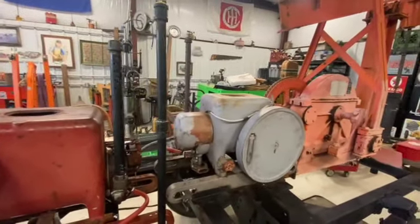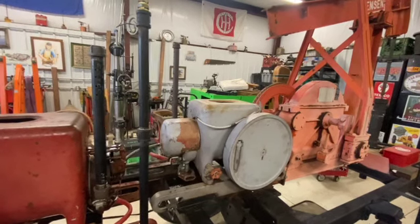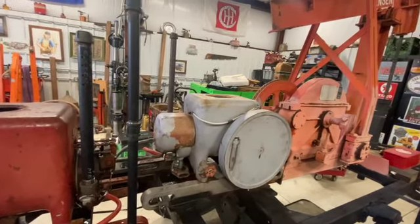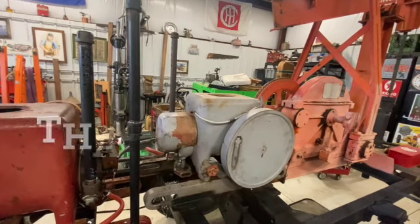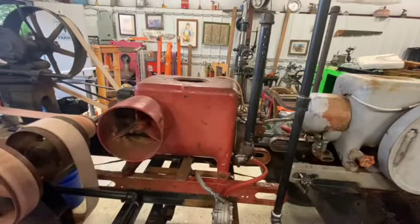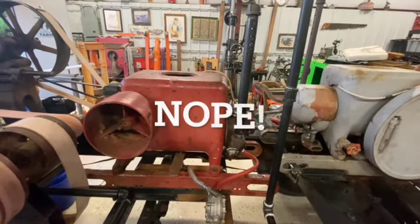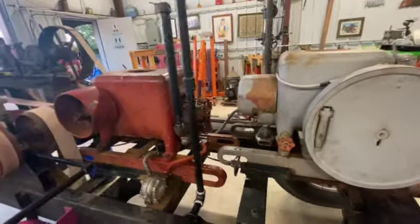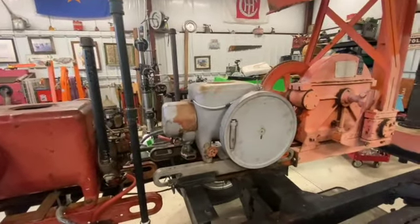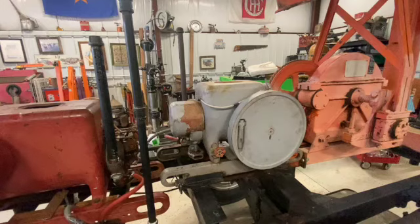This has been a refreshing break from working on these two rascals. I've got an oiler issue on this one — the oiler that delivers oil to the rocker arm ain't doing its job. There's a little reservoir in there; this thing runs for a while, builds up pressure, fills the reservoir, and is supposed to start delivering oil through the tube onto the felt pad to feed the rockers — so far that ain't working. This one about wore out my arm trying to get it started; it's fuel related. I've got good hot spark but since I'm running on propane I've got to figure out the fuel delivery. I'm out of time, but hey — I was a scheduler for 20 years for the U.S. Navy as a civilian, and panic deadlines were a way of life every day, so I know how to deal with this.